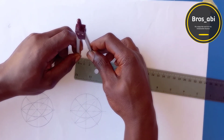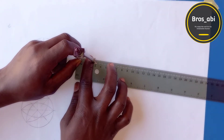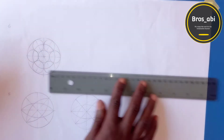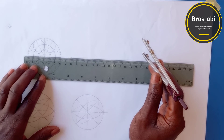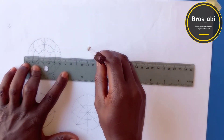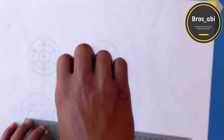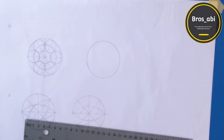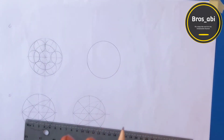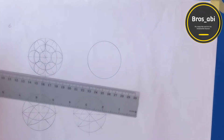That's 30. After drawing the circle, draw your axes — the vertical and the horizontal — that is the line passing through the center. When you are doing the line passing through the center, it must be done with a chain line. You must do it with chain line, all right.